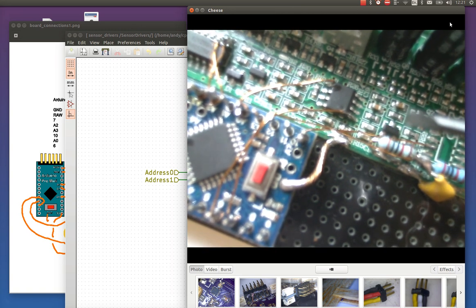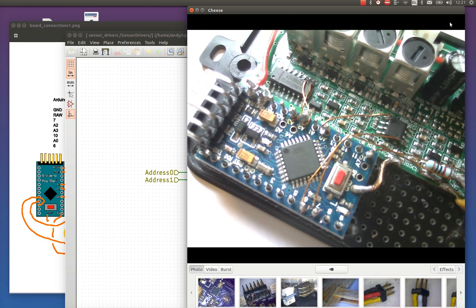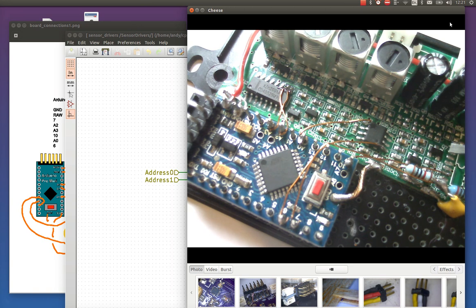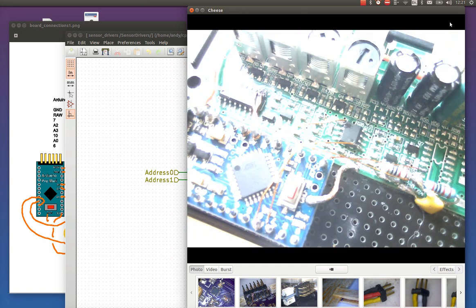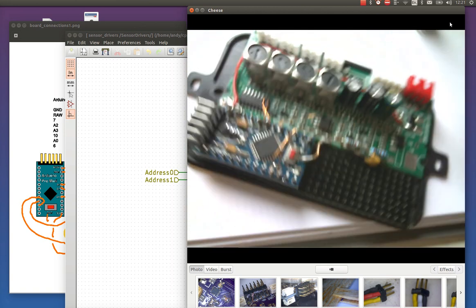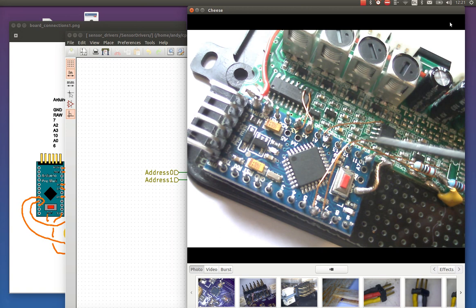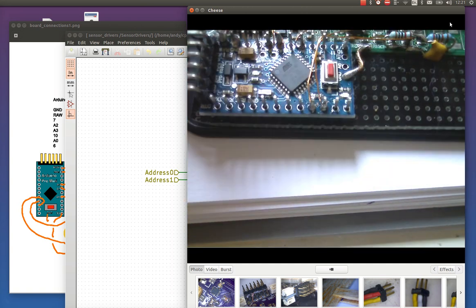There are a couple of different versions of this board but I think basically they are the same circuit. This is the second board I've made — I plugged everything in and haven't actually adjusted anything, and it has worked basically straight away. After having done the first board, by moving the microcontroller onto the board you've got a lot better connection, because the comparator in the Arduino is quite sensitive — you really do need a good ground connection between the Arduino and the car reversing kit PCB.